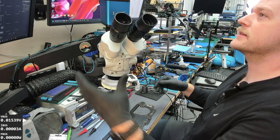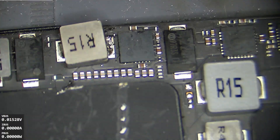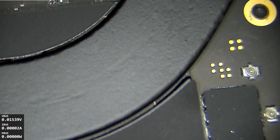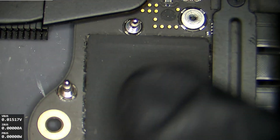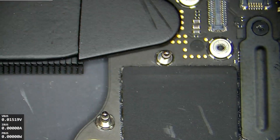I don't really know what they were up to — it looks like they were kind of making a mess next to the CPU MOSFETs. Why we would do this, I don't know. I think the first thing I'm going to do is just grab a donor and swap these so they're on there correctly. No missing screws in the device, surprisingly, which is nice. It's always fun to see — something doesn't open, so they just force it.